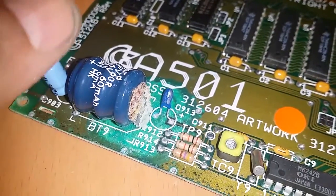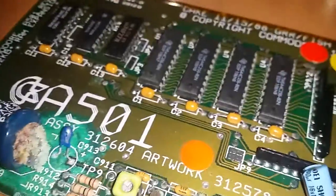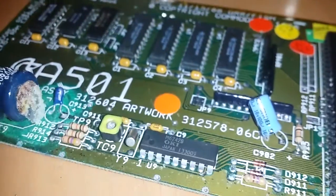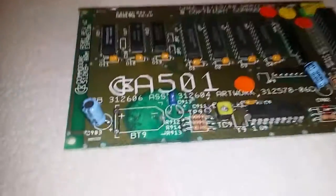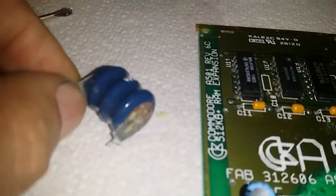I wasn't entirely sure if there was an actual battery on this, but for all the time it took — it took about five minutes with the soldering iron and the solder sucker to pull all the solder off the tabs and get it opened. I'll pull this battery off here and be back in a moment. Okay, that's the battery off — and there it is.